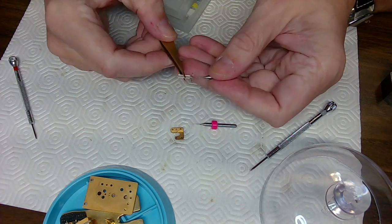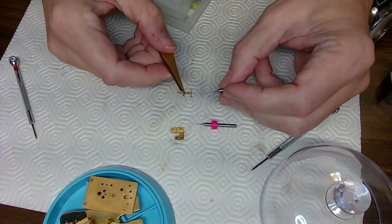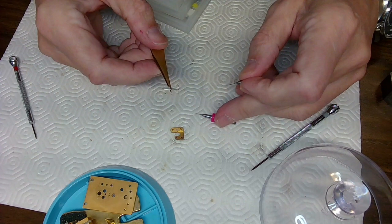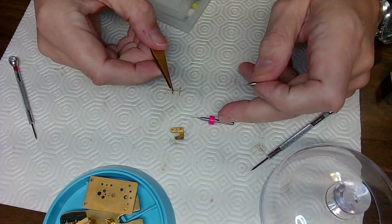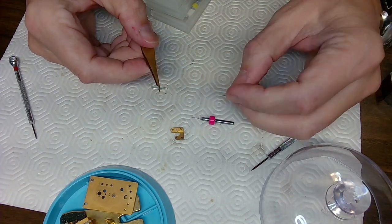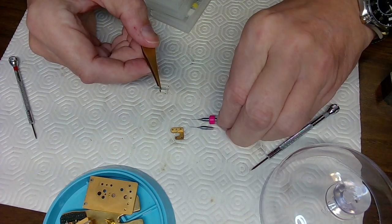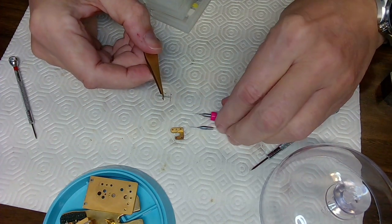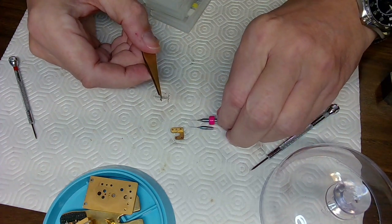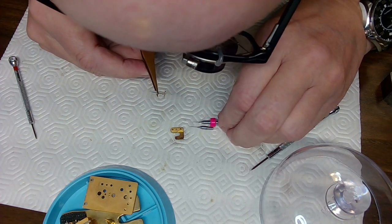So I may be able to drill a hole, but the problem I have right now is that I have to take this drill bit and put it in a grinder and taper the end. I have to cut it off just like I did this one, at basically the same distance, and then taper it to an MT3 taper to fit into my other doohickey that would be used.